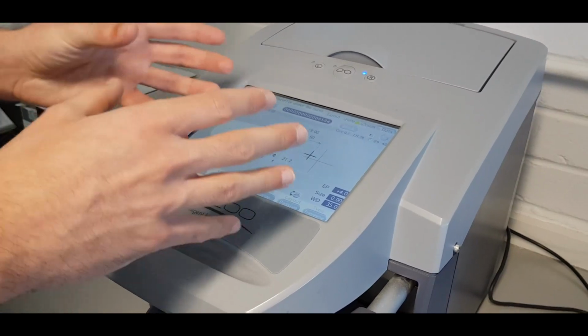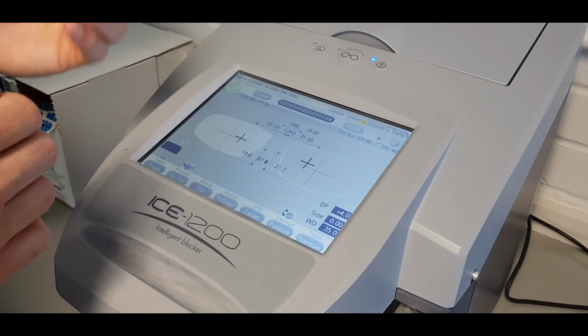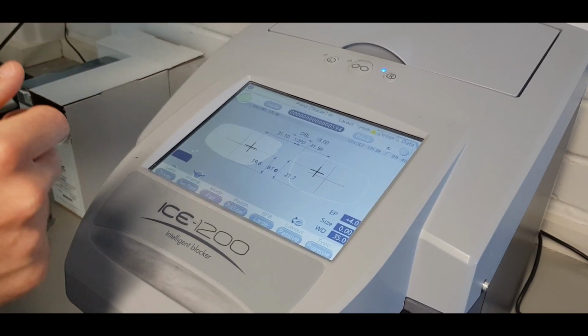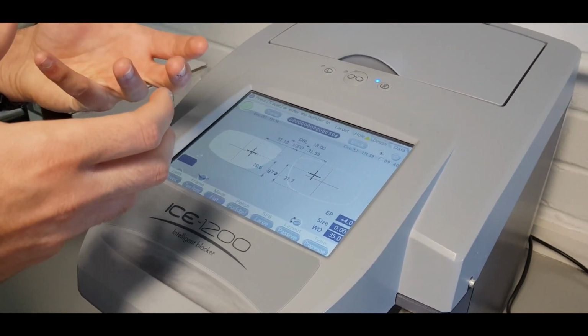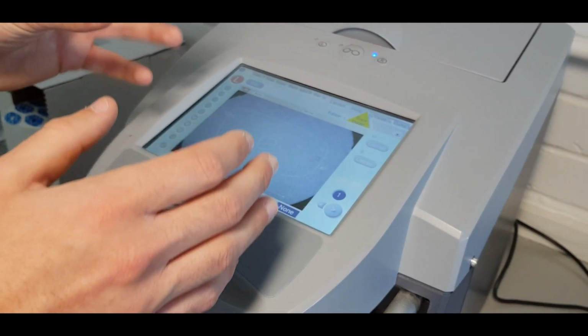So the real technical part of making a pair of rimless glasses is to program not only the size and shape of the lenses, but also the exact position of the drill holes. We're working here to tenths of a millimetre accuracy, and a tenth of a millimetre error can actually mean the difference from the glasses looking right on somebody's face to looking slightly wrong. So I'll show you here how we're able to really accurately position the holes to be drilled.